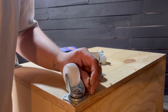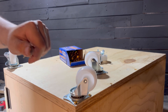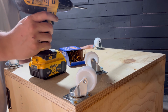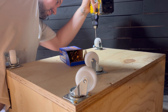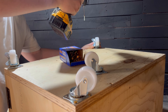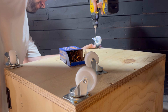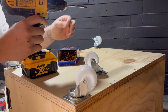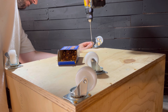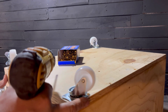I'm having to use different sized screws for these. I've got 40mm screws going straight down because they'll go through one layer of plywood and into the walls. But the ones on the inside — on one side it's a door, the other side it's a drawer, and the other side it's just empty space — so if I put those screws in it'd just go straight through and everything would lock up. So I came back around and used 10mm screws for those two holes. I wanted these casters to be as strong as possible because there's going to be a lot of weight on them, so I used the longer screws where I could. And also, these are my mother's screws — don't tell her I'm using them. They're only a couple of quid, but what's the point in going out buying screws when I have a box of hers?